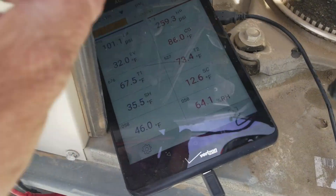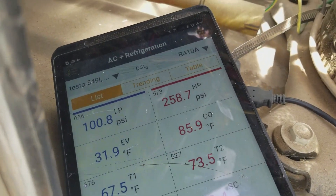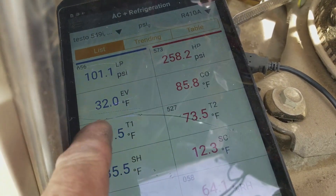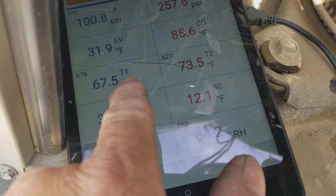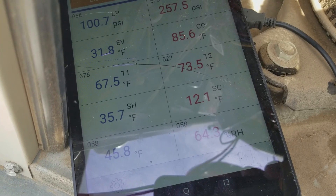Using an old Verizon tablet here — you can see it's set for R-410A refrigerant, and then you've got the pressures and what they correlate to. Here's the actual probe with the pipe connectors, and it converts and calculates the superheat right there on screen.